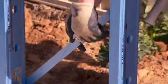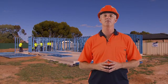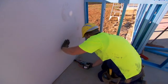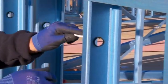Ensure bracing straps are tight and screwed to each stud. Having completed the wall frames, proceed with the installation of the next storey floor or roof frame. Aligned service holes make cabling and plumbing easy and straight walls give a great finish to the plasterboard. Follow-on trades will find working with EnduroWall wall frames a breeze. Install the hardy brace according to the manufacturer's recommendations.